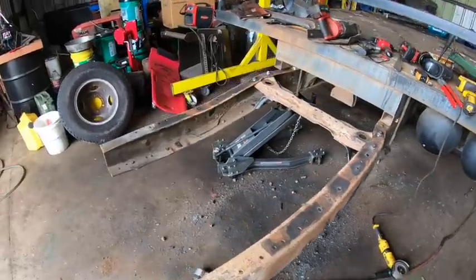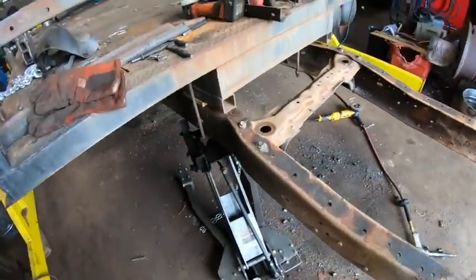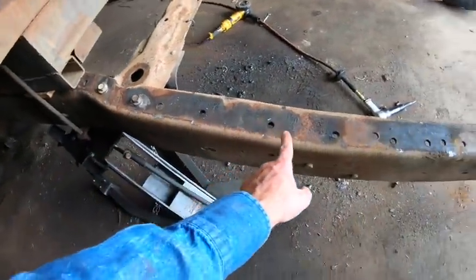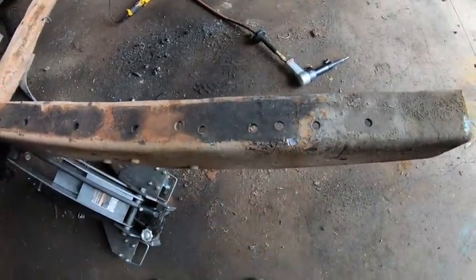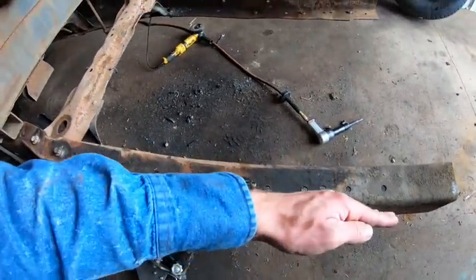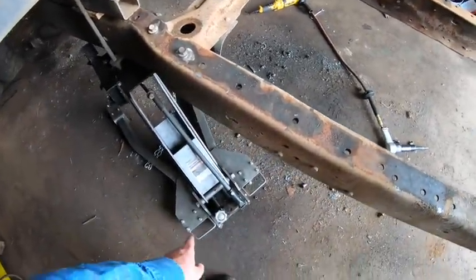of stuff riveted all over the frame on this, and it actually had some reinforcements. Like, there were these plates that ran down like this. You can still see the outline here, you know, where it ends there actually. And since I have to bend these in, I had to get rid of these plates, and that means all these rivets have to go.